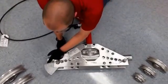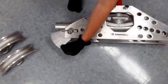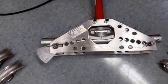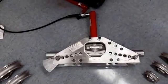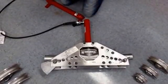You can see over here that it's starting at zero. We're going to try and get it all the way to 90. These do not account for spring back, so we'll have to bend a little bit past 90 in order to get a 90-degree bend.